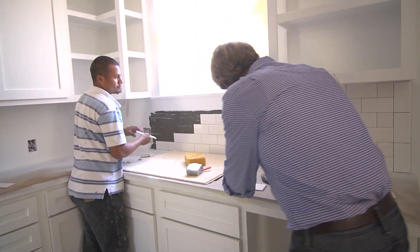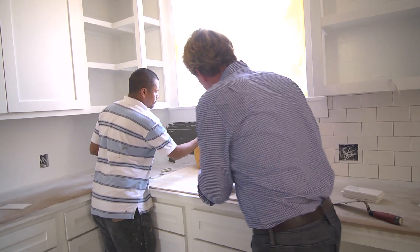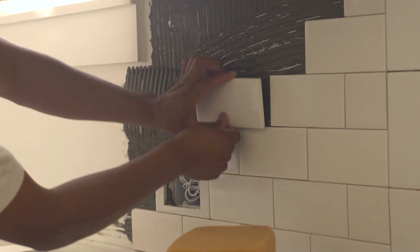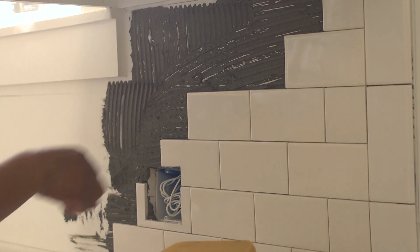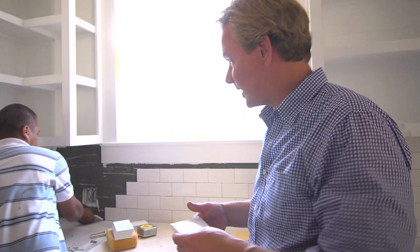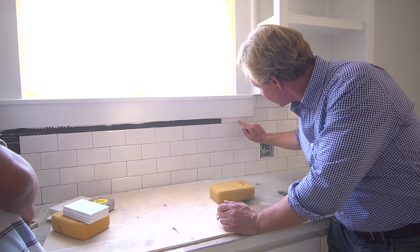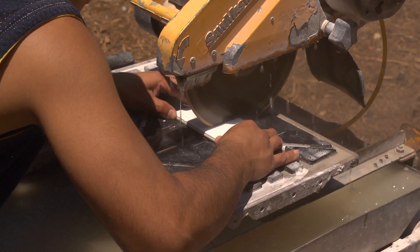You can see it's really coming together — it's gonna be beautiful. What he's doing is placing these tiles, and they're preset with a little ridge, so he just pops them on because you get a 1/16-inch space between one tile and the next. These are applied to the wall with a thin-set mortar. This little band will just be a piece of that tile, cut here with a wet saw.